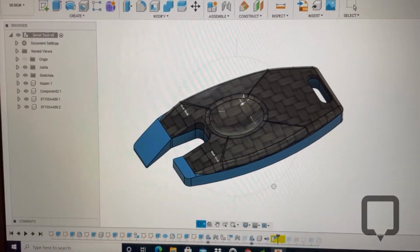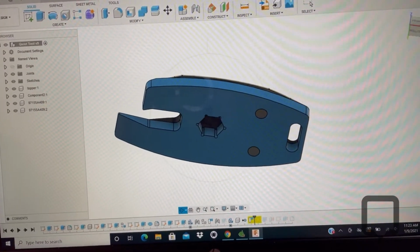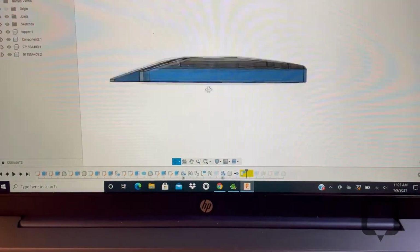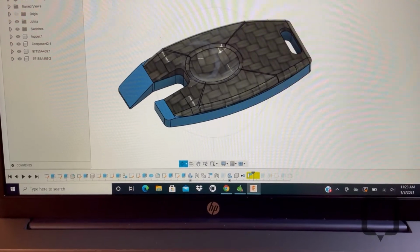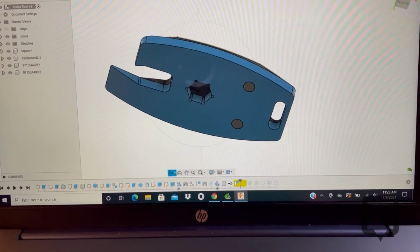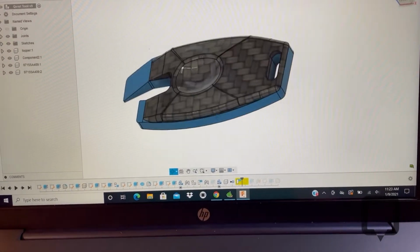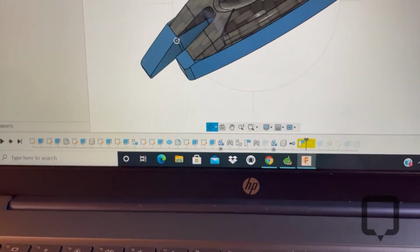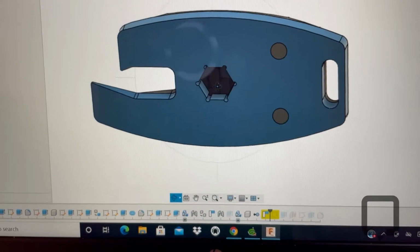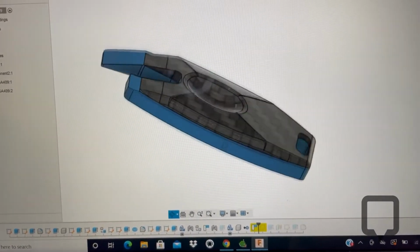So yeah, I designed up a little multi-tool here that will be maybe a version of aluminum. I'm going to be prototyping the aluminum one today. Fully made in-house, and then I thought it'd be really fun to have these toppers that'll be adhered to it. I got some pins, so it's pinned location wise, all 3D machined, little place for your thumb. So it's a pry tool, bottle opener, and it has a place for a 1/4-inch drive as well in the bottom of it.